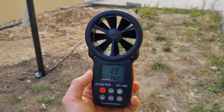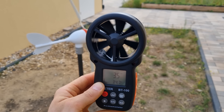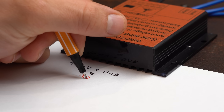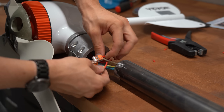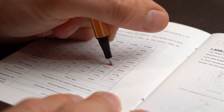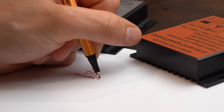At wind speeds of around 3 m/s this new generator spun nicely and created a slightly higher voltage than the first one. Once the wind picked up to around 4 to 5 m/s it reached peaks of up to 15V DC and was even able to charge my battery with peaks of up to 100mA — only around 1.5W of power, which is once again pretty useless, but at least it's something. All in all these wind generator tests were disappointing because I had hoped such wind speeds would create useful power. As it turns out these generators are definitely made for higher speeds, which makes me wonder whether I should try modifying them or come up with my own low wind speed power converter.